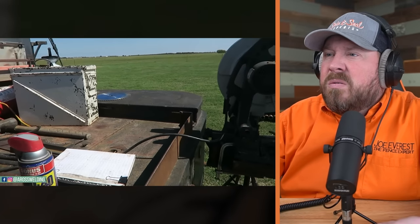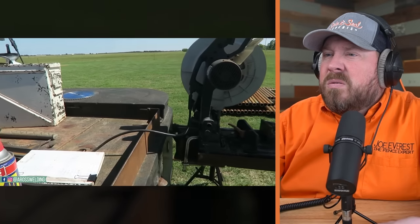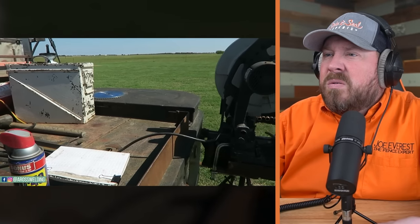It's a cold cutting blade, and I like it way more. It's way more accurate, with less burr compared to the abrasive blade, because that's all I'd ever heard of until. So that's actually the same setup we found just like this at Fence Tech in 2017, 2018. Before that, we were using the abrasive blades.